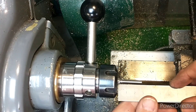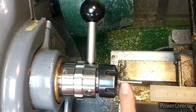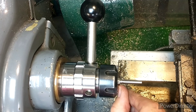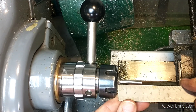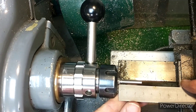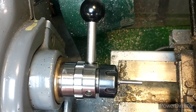The second thing we're going to do is reduce the size of the piston head at the bottom. This is 5mm diameter — I want 30mm of that, so that gives us a bit of leeway inside the cylinder so we can push the cap in a little way; it's probably only going to be one and a half mil, just to give us plenty of clearance. I've started to clean this one up but I'll just have to reposition it in the chuck, because we're not relying so much on the length of the piston anymore to support it.